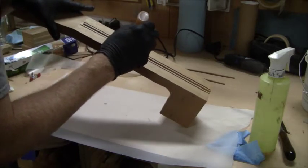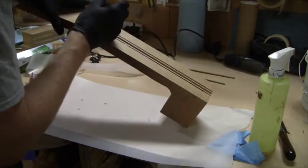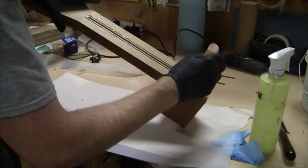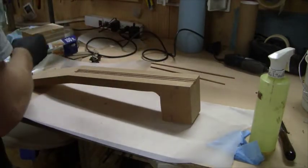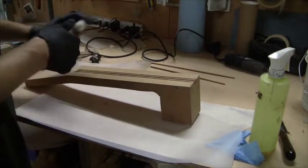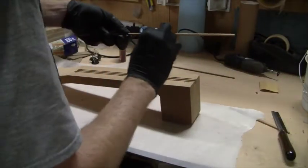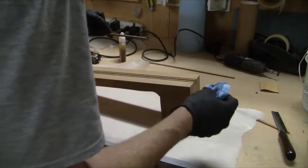like Paul Reed Smith does with their acoustics. They use a big chunk of carbon fiber down the middle of the neck, basically ensuring that the neck will never move, but it also means that the neck is not adjustable. So I've found this combination works really well. The carbon fiber adds a little bit of stiffness, extra layer of stability against twisting. That's never been an issue with my guitars. And it doesn't add any weight, and it still allows for easy adjustment with the truss rod. And so to me, it seems like certainly a no-lose situation. You gain a little bit of stiffness, you still get the adjustment of a traditional truss rod.